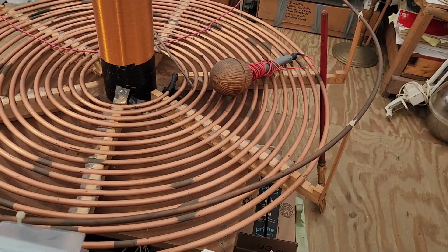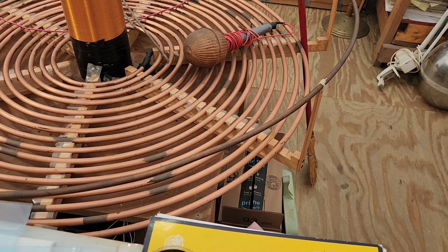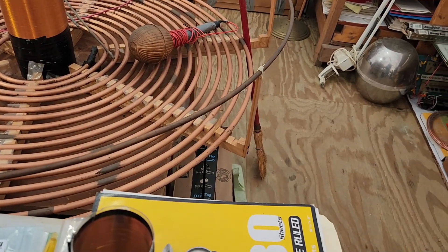So what do you think — what kind of coil gives us the best charge? Also, don't you think flat plates would have a lot more surface area and give off a lot of charge? And that leads me to think about tubing — wouldn't that give us a lot of surface area with both the inner and outer diameter? Or would the ID and OD interfere with each other because of Lenz's law and eddy currents being created throughout the wall?